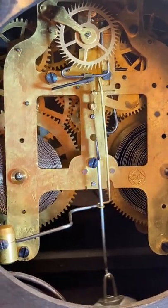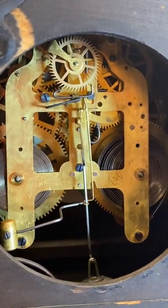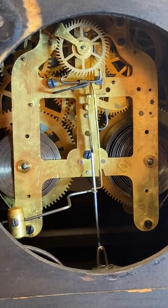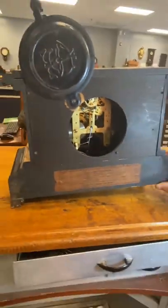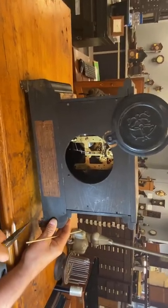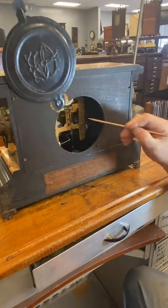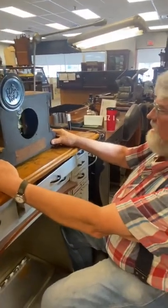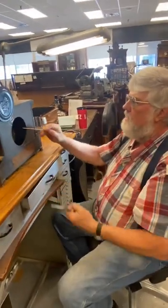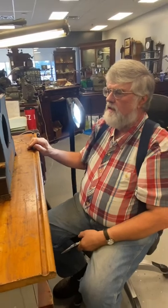We're also going to do some tall case clock beat adjustments shortly. But on mantle clocks, find where you're going to place it, put it on a level surface — it doesn't have to be perfectly level — and then adjust the beat for where it sits. You could even have the clock running on an incline if needed. I set all the clocks I repair on a level surface. If your house is a little lopsided — like mine, a 1790s house where nothing is straight or level — whenever you move the clock you'll need to readjust the beat. Thanks very much, check back for more videos from the House of Time.